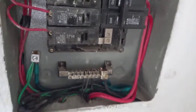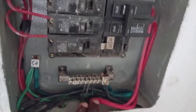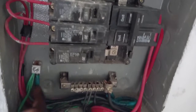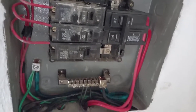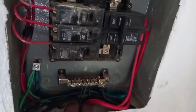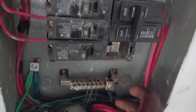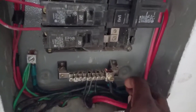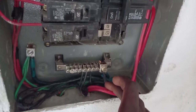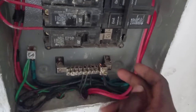Some people ask me why you link these two bars. As I said before, the neutral wire can be active at times because it completes the circuit, and it's linked to the ground bar which gets rid of waste current to the earth. Here we have the main neutral from the power supply and the main ground from the power supply both coming into this main lug.